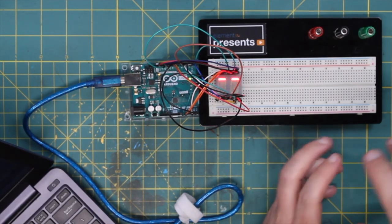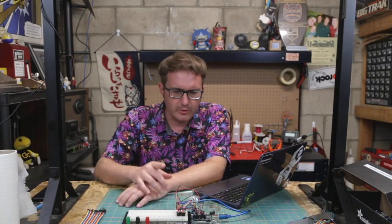I've got this first unit wired up and wrote a simple variation on the Blink sketch that just cycles through each of the pins to turn them on and off. This is a common anode LED display, which is a little bit backwards from what I'd normally work with, like a common cathode. You've got to wrap your head around it — on is off and off is on. It's just a matter of turning on the anode for the digit you want and then turning off the particular segments you want illuminated.